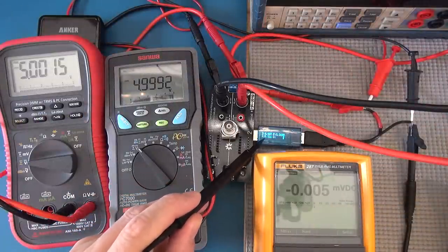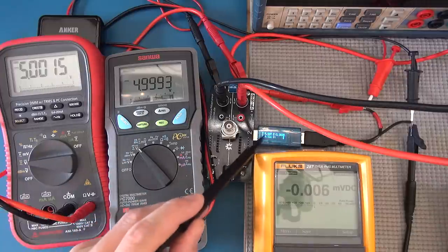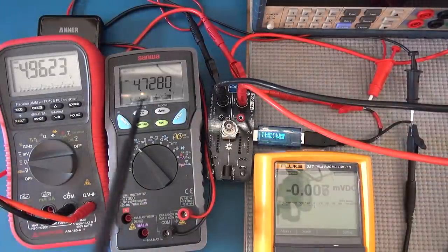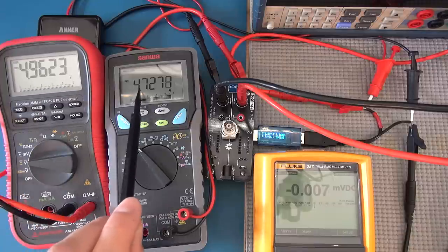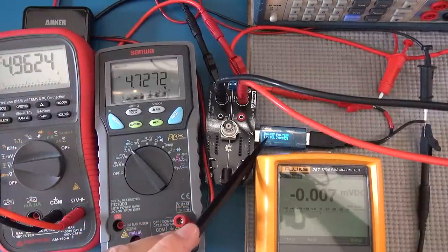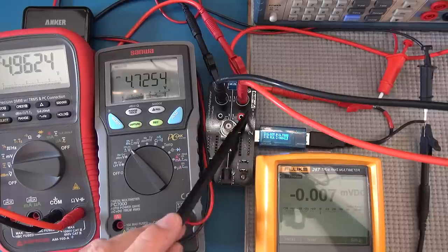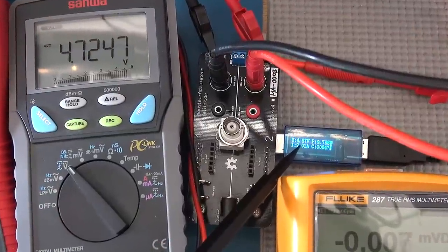For this device I'm not too concerned about its current measurement resolution; what we'll check is the voltage drop at higher current. I've disconnected the micro current for all high current tests so as not to damage it. Dialing up to about 2 amp, we've got an input voltage of 4.9623 and an output of 4.7, so about a 0.2 volt drop. I also note there's an internal reading error when you have higher current flowing through it — the device is measuring 4.87 whereas the actual input is 4.96, so about 0.1 volt of voltage reading error.